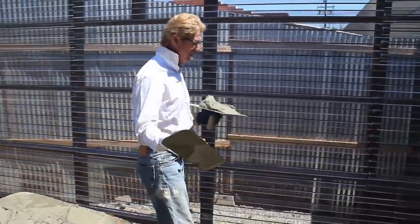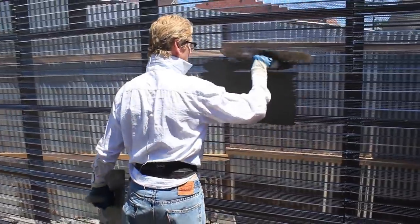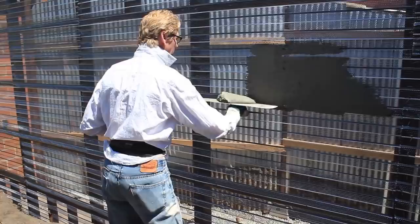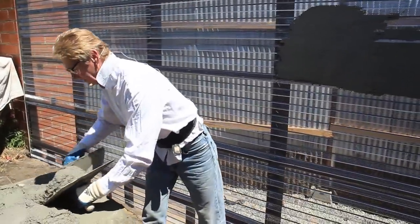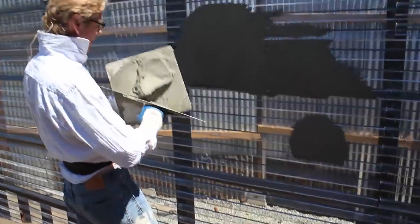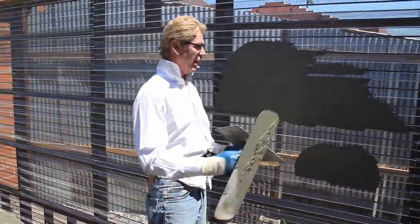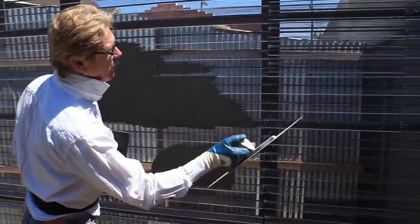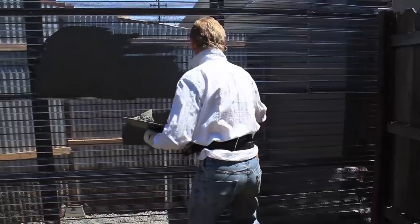You can save a lot of money doing it this way. The idea is to press just right - notice there's not a lot dropping. This is good, perfect mud for this. I'm not wasting a lot because I know how to mix well. If you don't know what you're doing you'll push too much pressure and it drops down. Right now I've got a very rich mix because if it's rich I won't lose too much. What's happening behind the lath is it's keying - mushrooming behind it. When we're done we'll go behind and trowel that keying down.